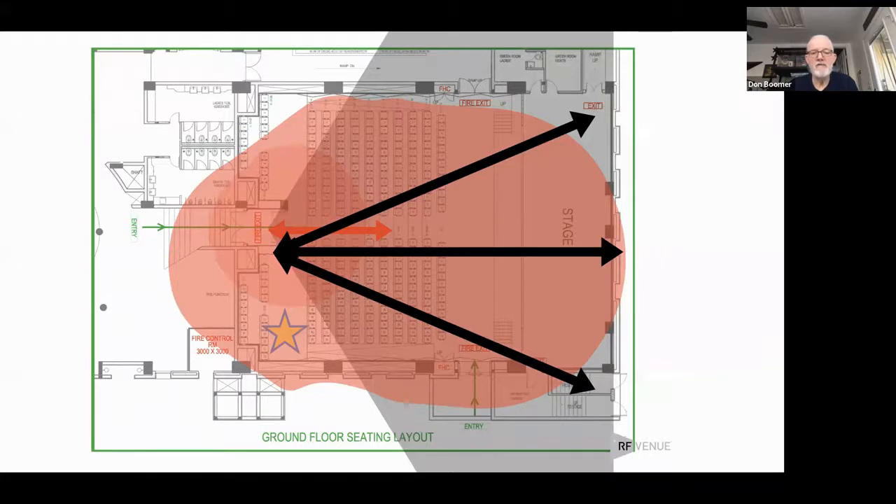If you're using a pair of paddles and you put one in each wing, the only option left is to turn the in-ear monitor transmitting antenna 90 degrees — move it to the back wall of the house to minimize overlap. Alternatively, you can have both antennas on the back wall. A little tip: if they're both on the same wall, you can pick up a little extra performance for free by moving the in-ear monitor antenna a bit closer to the stage, because it's not spreading out sideways until it gets farther up, so it's avoiding your wireless receiver antennas.